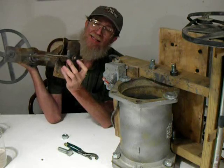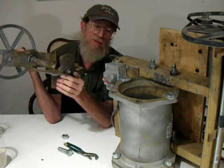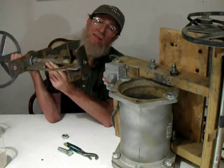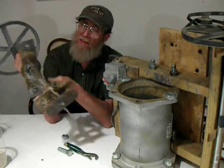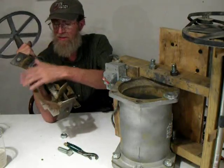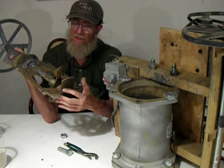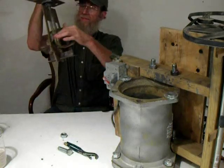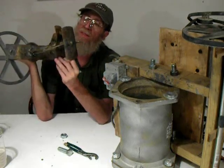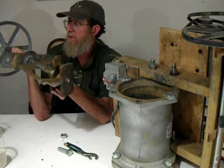This is going to be subject to a lot of wear. As it wears, I'll simply braze brass on it and continue using it that way rather than trying to put a proper bearing in there — I'm afraid the sand would wear it out very quickly. It seems to work pretty good, being so small, steel against steel. The impeller was a piece of pipe, and I just took a piece of scrap steel and cut out a section of the center. I used the same sections also for an inner collar. These are nothing but lawnmower blades — just bent lawnmower blades I welded on there, designed to work counter-clockwise and push everything in a downward direction. It's very simple with very few welds.